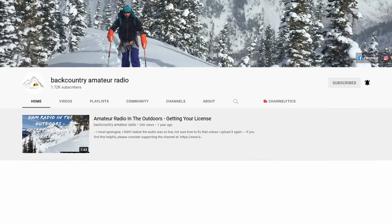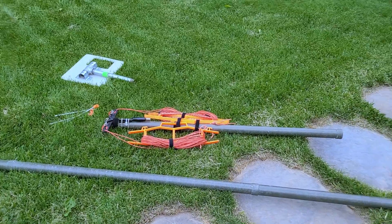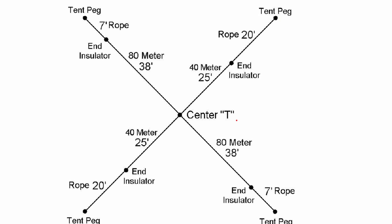For this experiment I'm going to be using my NVIS antenna with military poles. The pattern comes from a DX Engineering — it's actually a military design, the AS-2259 antenna. I'll put a link in the description below. This is an antenna I've used on a number of occasions and I keep it in my garage ready for an opportunity like this. The footprint for this antenna is about 45 feet in four directions.